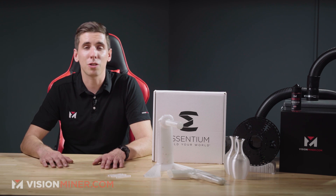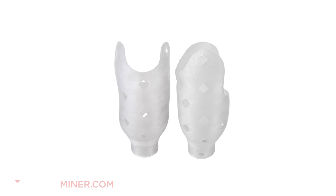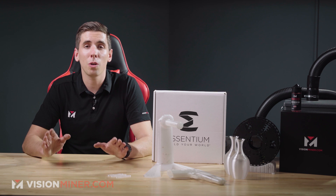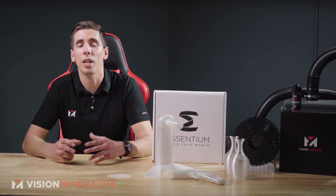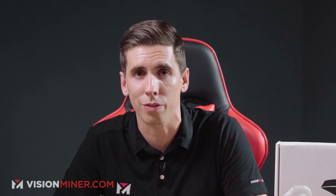You don't need a heated chamber. You'll see it used for all kinds of things like handheld tools, gauges, location fixtures, general assembly fixtures, and check sockets for prosthetics. It's also unaffected by humidity, so drying isn't that big of an issue, and hydrolytic resistance is very good, so you can use it in water and underwater. It's also strong enough for lightly loaded fixtures, and there's a total range of colors available if you need to color-code in your shop.